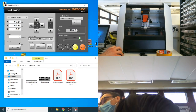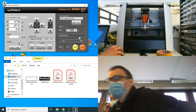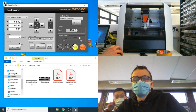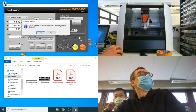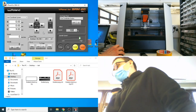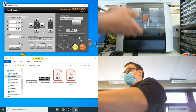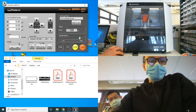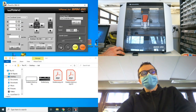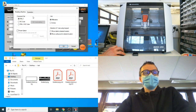Press Z+ to move the tool up a few millimeters. You can still fine-tune the XY position at this point. Once satisfied, click the XY button in vPanel, confirm you want to change the origin, and now we're ready to mill. Before milling, close the lid and verify the control software settings.